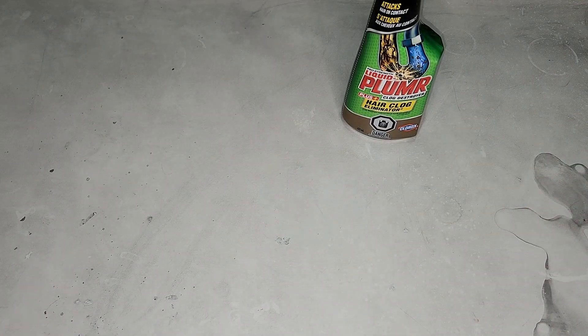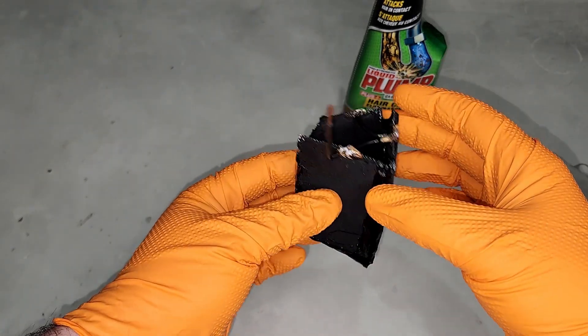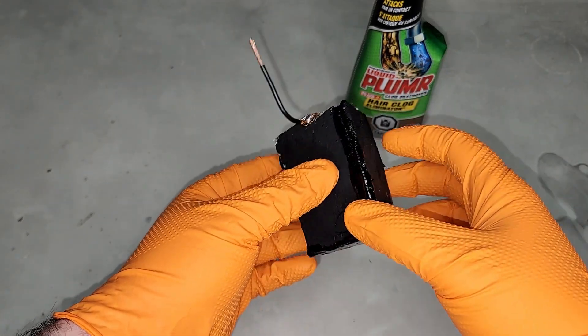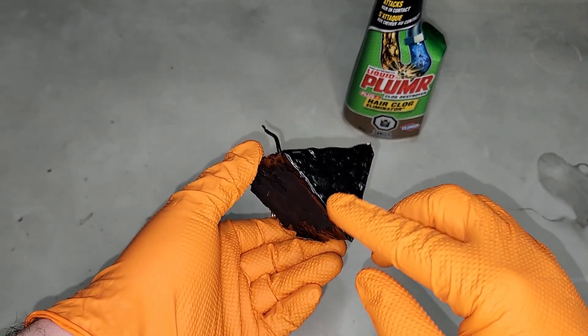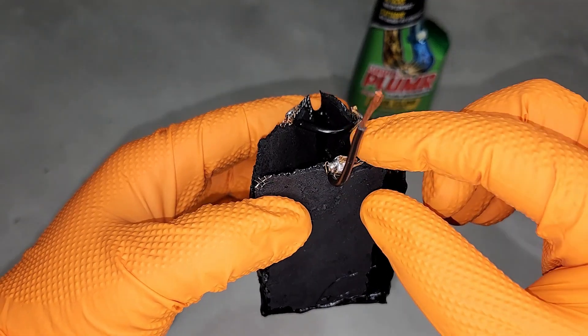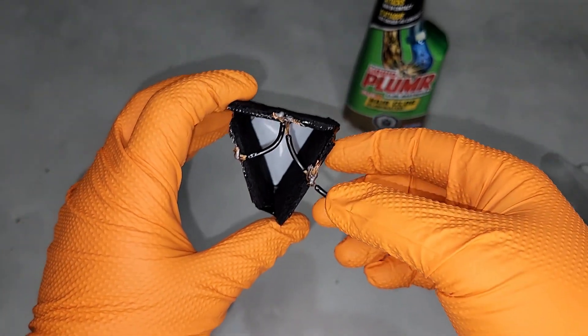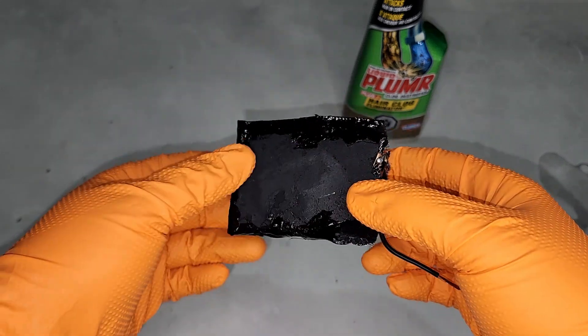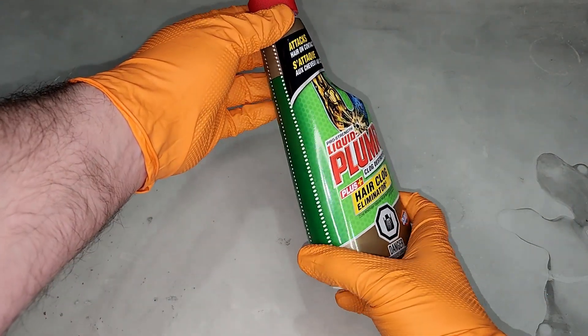The cathode is where it gets interesting. I made it myself using plastic, activated charcoal, and manganese dioxide harvested from spent AA batteries. This design boosts performance significantly over loose charcoal and is cheaper than using graphite. If you want to learn how I made it and the ABS glue that holds it all together, I've got a separate video linked in the description. Now that we've got our parts, let's build.